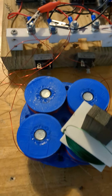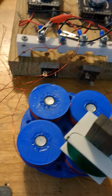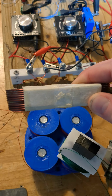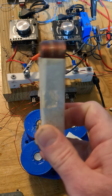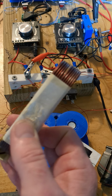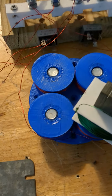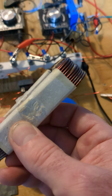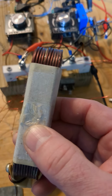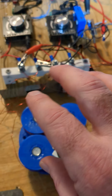on a regular rotor of an alternator, okay, you have a coil. Let me get a coil. Here we go. You have a coil that's being powered by a battery, so it's direct current. And as the coil rotates, right, the direct current is still always in the same direction. So it's not shrinking and growing and switching directions like I'm doing here. Instead, it's always going in the same direction as it rotates. Therefore, back EMF isn't a problem in a generator, because you're not growing and shrinking and collapsing a field. It's always flowing in the same direction, and you're rotating the coil itself.